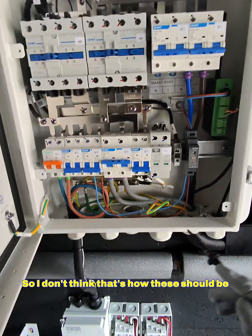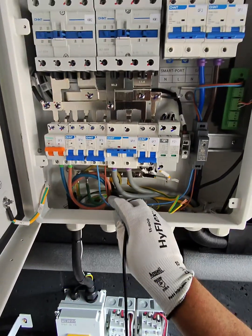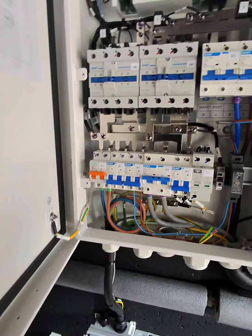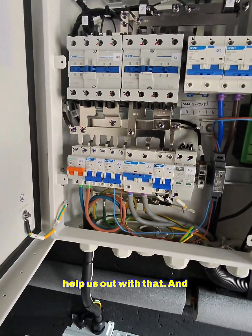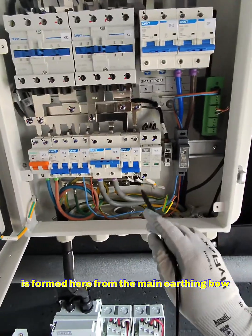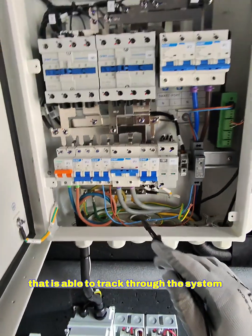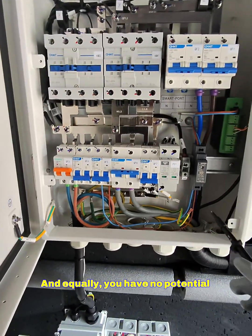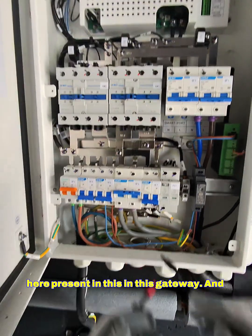I don't think that's how these should be set up. The way we do it — as you can see here — we've got that little fly lead in. Our earth electrode comes in here. We pop the earth electrode into the main earthing terminal of the gateway; that provides the backup for us when we are in a connected state with a PME supply. We're supposed to fit these electrodes to help us out with that, and then when we go off-grid the neutral-earth bond is formed here from the main earthing bar with all the earths connected. If there is a fault, it is able to track back through the system to the source reference on your generator, and equally you have no potential differences between effectively two earthing systems in your installation.